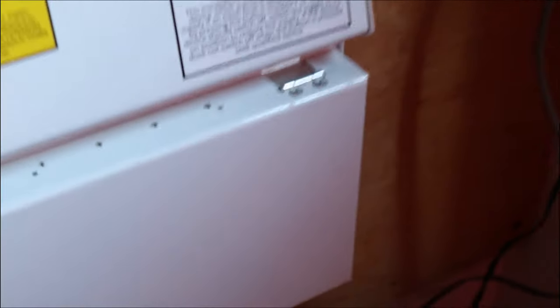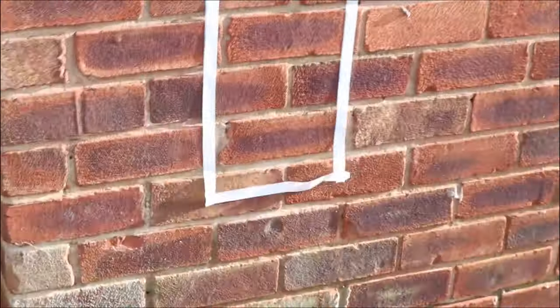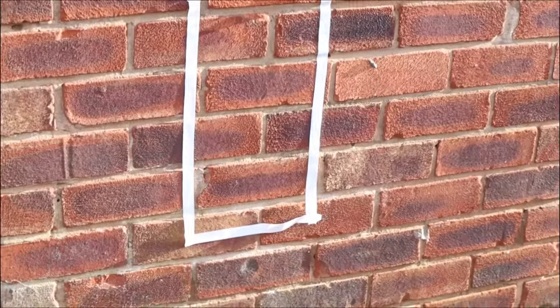That's the bit that has to be done away with, the looped supply. The box on the right with all the circuit breakers and the meter at the top were replaced within the last five years, so that was reasonably up to date. You can see the cable will run out of that cupboard, along under that bedroom, and come out at the charge point position. There's the car up the drive - that is the bedroom the cable will be running under from the meter box to the charge point.